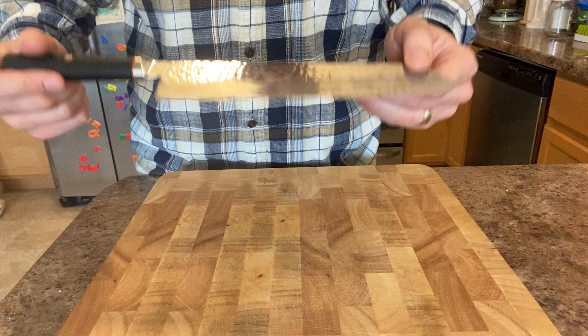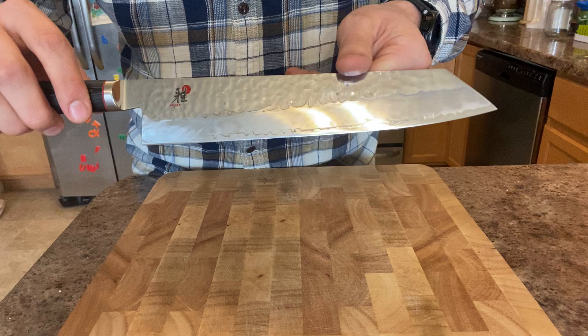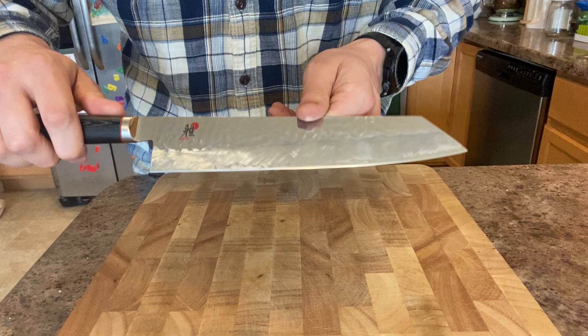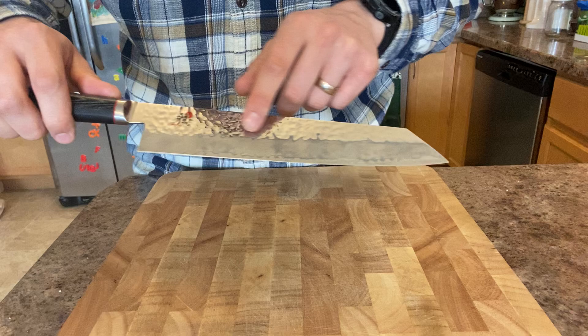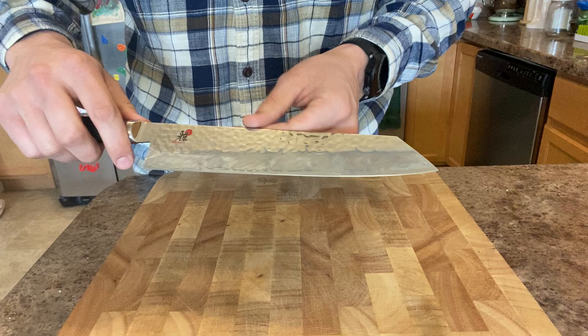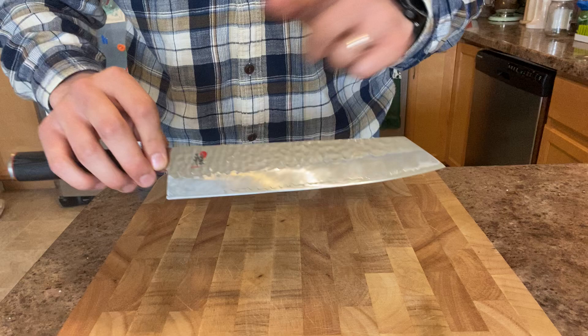As shown, it's about ten thousandths behind the edge at about 11 degrees per side as sharpened. This one did come with an issue — there's a huge recurve in the back half of the blade so it didn't make contact with the cutting board. I chose to fix it myself by grinding it down on a stone, grinding up the heel and flattening it back out. That's why the finish looks a little different than factory. I will say Zwilling and Cutlery & More both offered to replace the knife despite me having done this — their lifetime warranty is solid and they stand behind it.